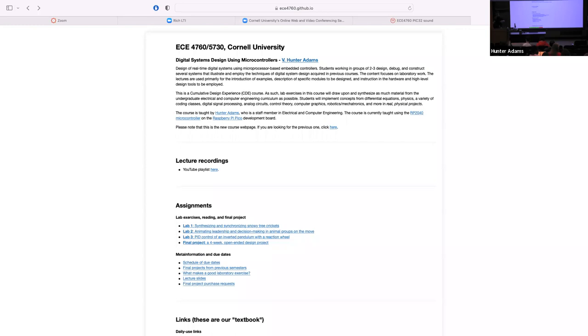Our dithering issue was that we had an interrupt that calculated all the values from the IMU and gyroscope, and it seemed like it was updating way too fast for the dithering. So if there was any delay, it would really change our value.